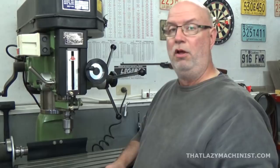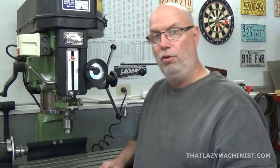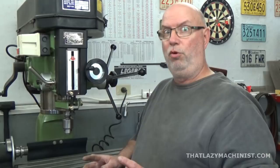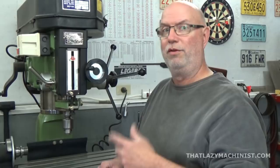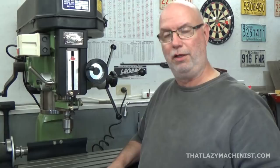The simplest solution is to set up a DRO on the quill — but not just any DRO: a poor man's DRO. We're going to be setting up a six-inch vernier caliper that I acquired for the majestic sum of $18. And it's not just a poor man's DRO — it's a cheap poor man's DRO. Because once I'm done, that vernier caliper will still be usable as a vernier caliper. It won't be permanently mounted on the machine.